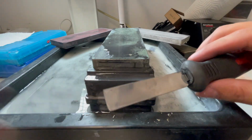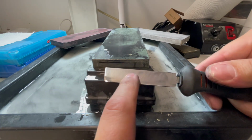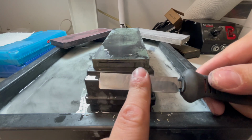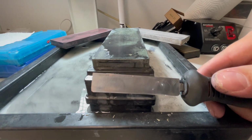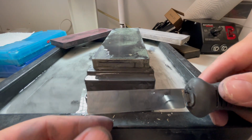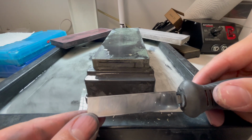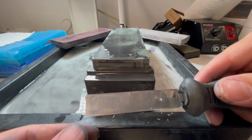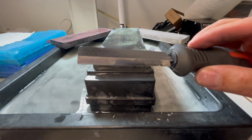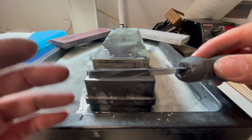So, in summary, we took this knife and we checked the shape of it, and the shape had a big divot, right? Or not a big, but a sizable bit of material that was causing the tip of the knife not to be able to form a burr. So we went and backed down to a lower grit. My 120 grit wasn't really grabbing the way it is, and I'll probably make a video in a moment about me using a stone to flatten the knife. But I think the great thing is we went from that rougher stone up. We proved every time that we were flattening it out. We used the Sharpie, and we got up to 8,000.